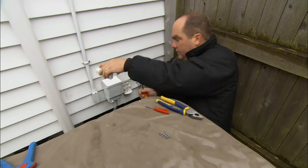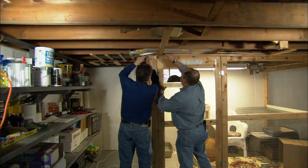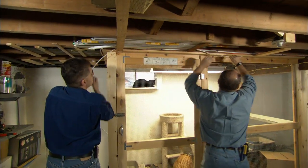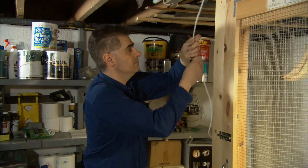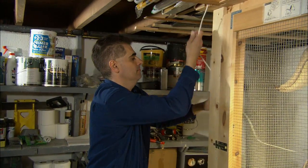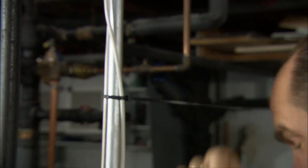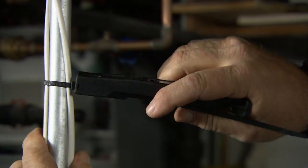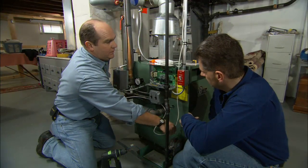Install the cover. Now let's fish that wire from the outdoor sensor back to the control up here. Once we get it all run, we can staple it up into place — make sure it doesn't kink. I want to snug up the sensor wire against the conduit, and for that I use tie wraps with a special tool that snugs it up and clips it off. There's our wire to the outdoor sensor that tells us the temperature outside.